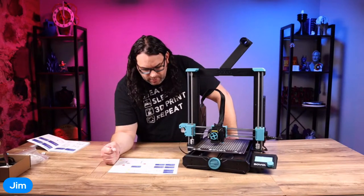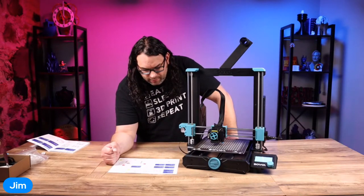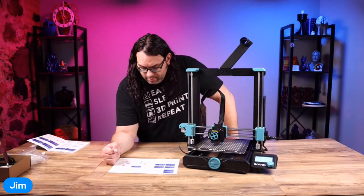After the machine stops, go back and click probe Z offset to adjust the difference between the nozzle and the hotbed. Don't forget to click save settings after you adjust the Z offset. About 0.2 millimeters, the thickness of a sheet of A4 paper. When you drag the paper, the nozzle can scratch the paper slightly. That means its distance is suitable. And don't forget to save that.